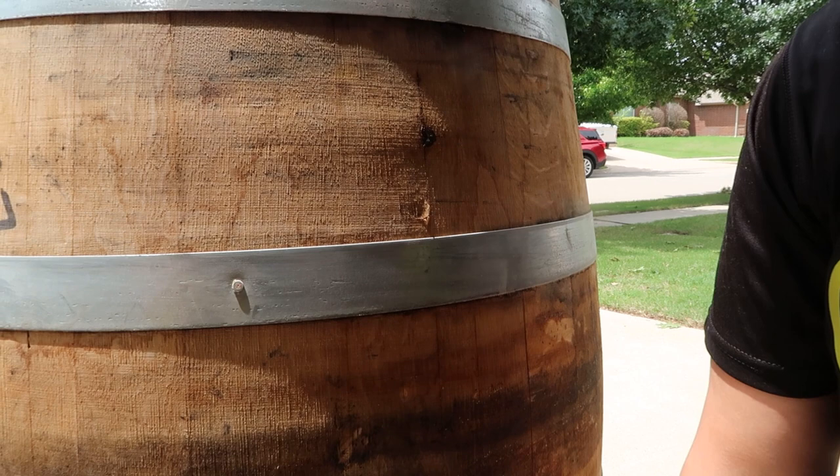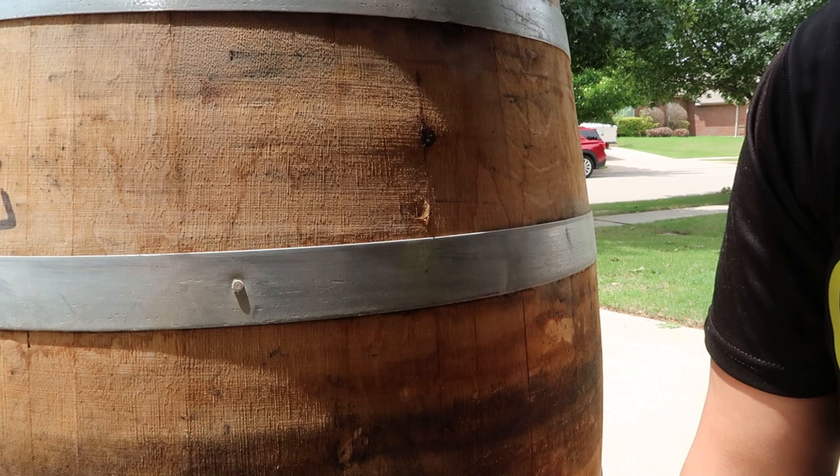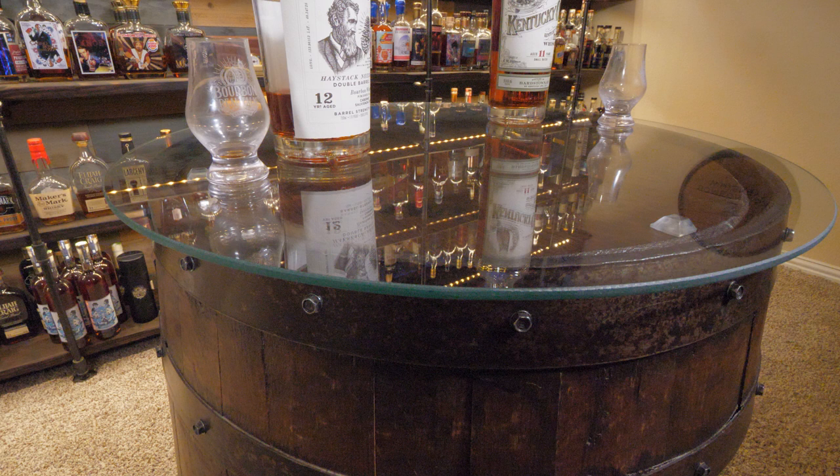Do you use an orbital sander or do it by hand? I just did it by hand. Is there a risk in using a mechanical sander? Not so much a risk — I just didn't want to mar any of it. Even sandpaper leaves scratch marks, but the nice thing about the rusted true whiskey hoops is they're not galvanized, so they're already going to show those imperfections — less of a concern. After cleaning up the hoops, I secure all the staves and hoops together with self-tapping screws — hex-top screws driven in with my impact drill.